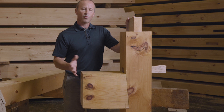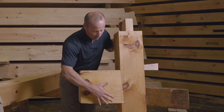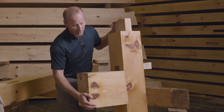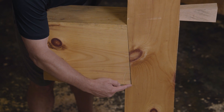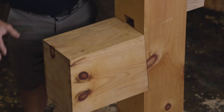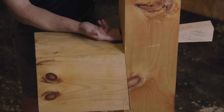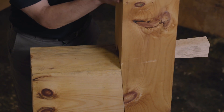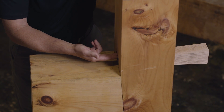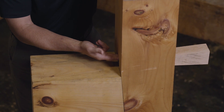Now that the joint is together, it's worth pointing out a few things. Notice that the entire cross section — the full eight inch width of the beam — is bearing on this one inch deep shelf, which runs all the way across the post. Also note that the top of the mortise is perpendicular to this surface, so when you're chiseling that, as Gabe has done, it runs straight through, not on an angle.